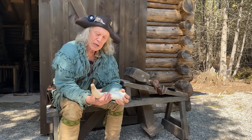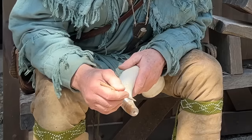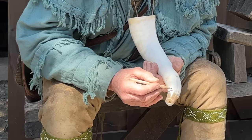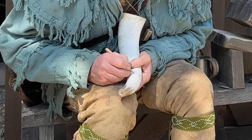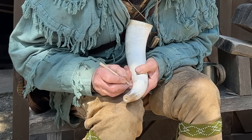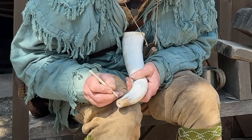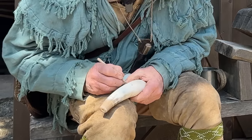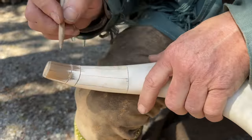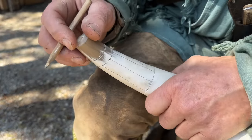I'm going to get back at this because I've got a lot of work to do. In order to make the octagon, I've divided and scratched in a line that basically divides it into four sections that follow right through that raised ring. Now all I'm going to do — I just do this by eye, it's fairly simple — is divide them all in half. When I'm finished I'll have the markings and the guideline to start my filing process. What I have now is eight equal-spaced lines around the entire horn that follow right through to the tip. Now I'm off to the vise to start filing those flats.